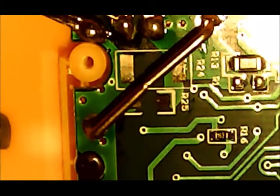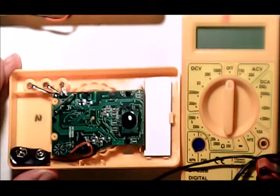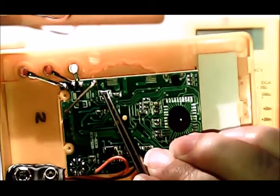Well, that is a known resistor, it has a known resistance, and it's probably 0.1 of an ohm. I can't measure that amount of resistance with my cheap multimeter, but it should show it as a dead short. So here we go. The resistor we're going to measure is, first off, the resistance of the shunt bar, then we're going to measure that resistor there.